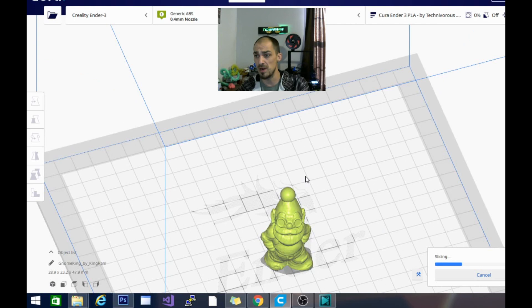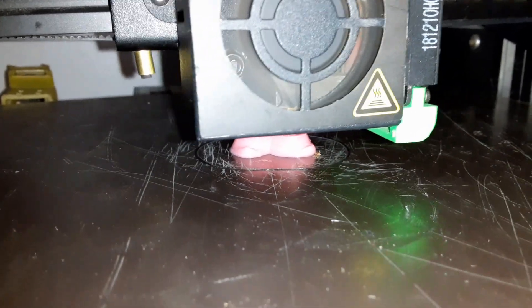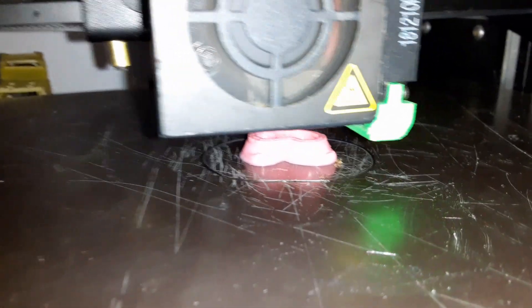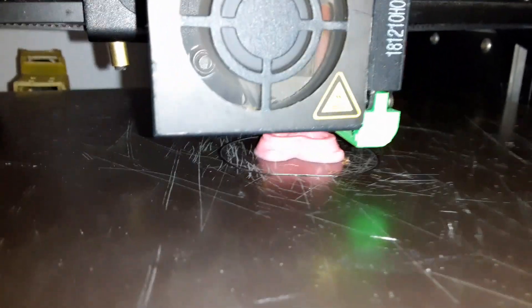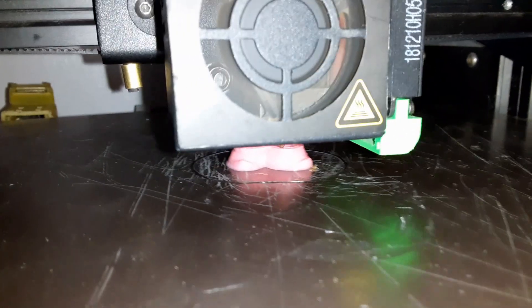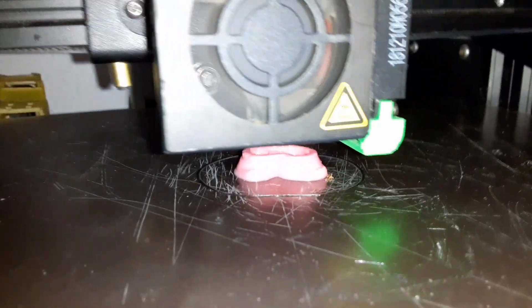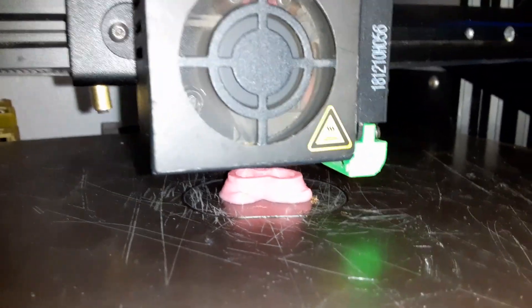I'm going to grab a little bit of video of it printing with the hollow center so you can see what I'm talking about. As you can see, it is printing a hollow shell — there is no infill inside there. This is equivalent to doing vase mode with five shells, you could say. We are not using spiralized mode obviously; we would have ended up with way too thin of a wall and it wouldn't have been able to put our top surface on. We will let this model continue printing and then check back when it's done.